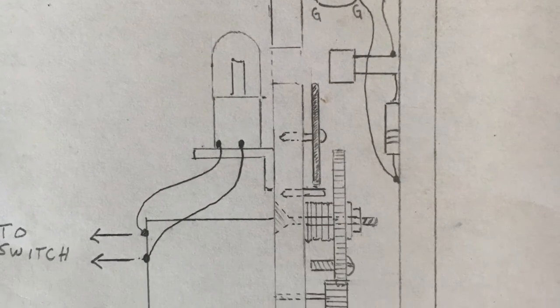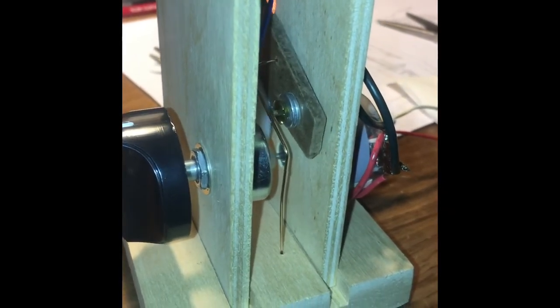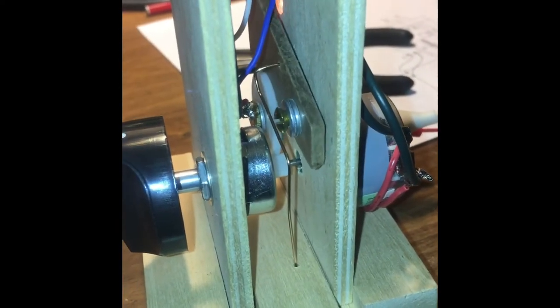The bells that were originally connected to this console did not come along with the console, so the vibrato effects were not there — the switches were on the console but they didn't do anything. I don't like having dead switches, so I did build a little unit to provide some kind of animation when those switches are thrown. What I ended up designing and building was a tremolo unit using a light dependent resistor, a motor-driven shutter, and a light bulb — that provides tremolo effect, although not vibrato effect. Even though this unit is not built in the same way the originals were, I preserved the fact that it only operates on the harp, celesta, and quadra bells; the other bells are not affected.